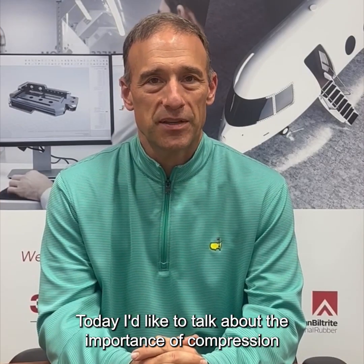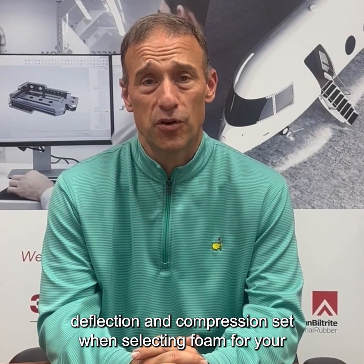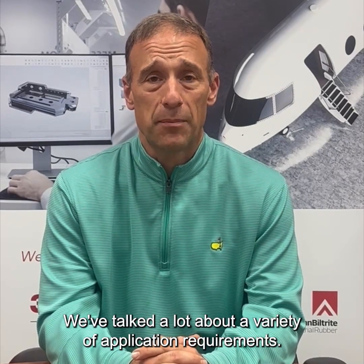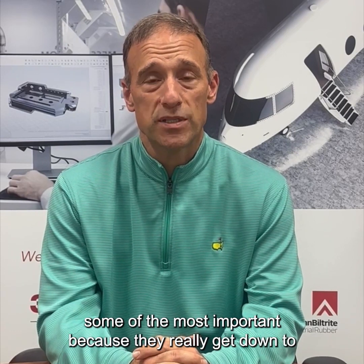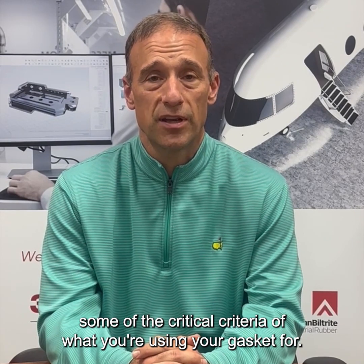Today I'd like to talk about the importance of compression deflection and compression set when selecting foam for your gasketing application. We've talked a lot about a variety of application requirements. Compression deflection and compression set are some of the most important because they really get down to some of the critical criteria of what you're using your gasket for.